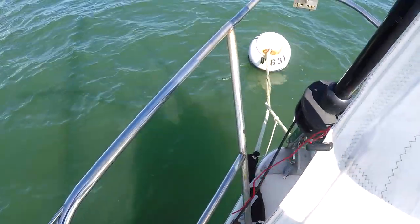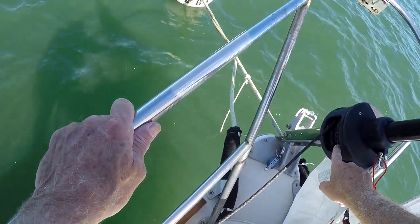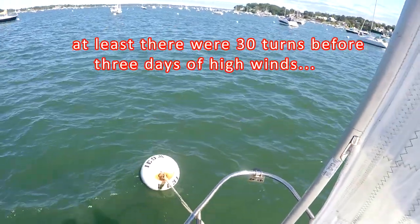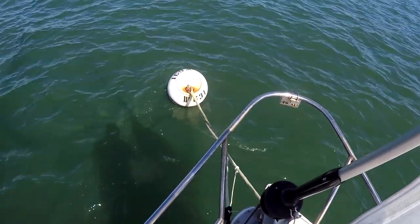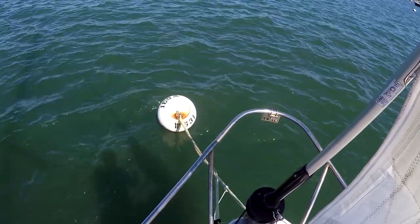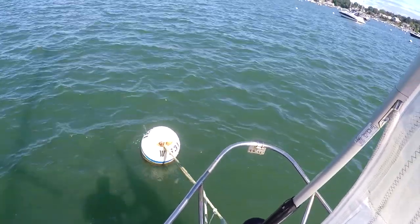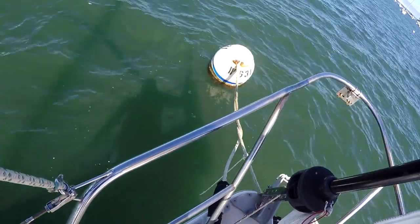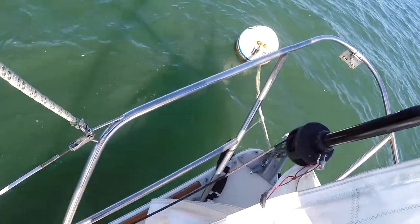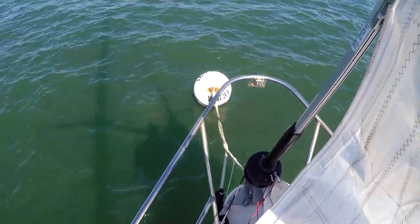When you get ready to rig the sail, you want to make sure that the furling drum has the necessary turns on it before you put the sail on. Here I have about 30 turns — that's what the book recommends — and you want to make sure the turns go the right way. This sail has the UV material on the starboard side, which means my turns are clockwise when put on before the jib is positioned. That way when I pull the furling line, the drum turns counterclockwise and rolls up with the starboard side of the sail exposed. When taking your initial turns, keep a little pressure on the furling line so the turns roll up smoothly on the drum and don't bunch up in one place.